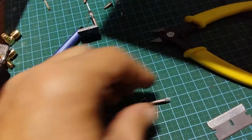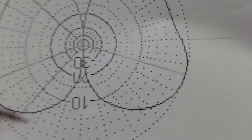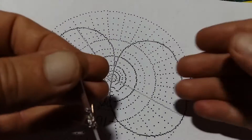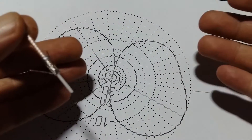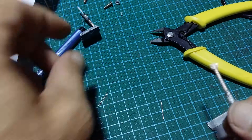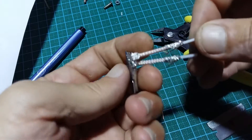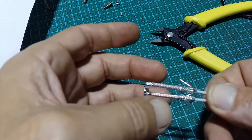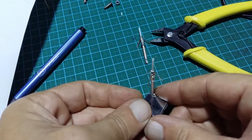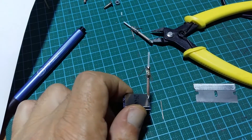It is not important to be exactly 45 degrees because there is another diagram. If you put less than 45 degrees you will get something like a dipole with equal radiation shape, slightly downward. Downward means if I put the antenna upside down as I prefer - because if I fly away from me I want to be in this position. If I fly toward me okay, I will have some losses, but every second flying toward me the picture will get better. I have no spare board so this is the final version. Those two antennas should be as much the same as possible.